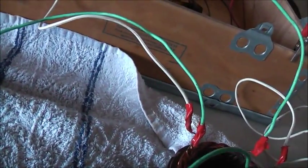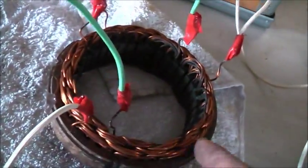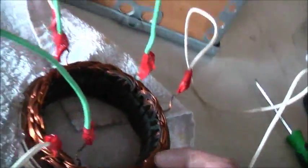The generator should work. I'll probably put that to the neutral side of the F&P generator, and the three phases are connected to the three phases of the F&P generator. It's going to pull a lot of power because it's quite thick winding, so I'm going to have to find a way of turning this thing — it's going to be pretty hard to turn under a load like this. These Nippon Denso ones have got nice stainless steel slip rings — interesting.